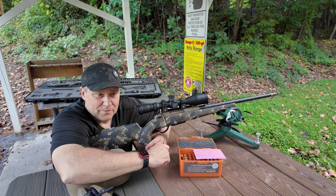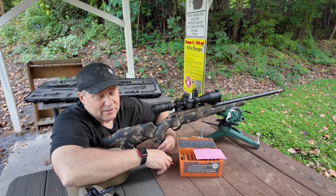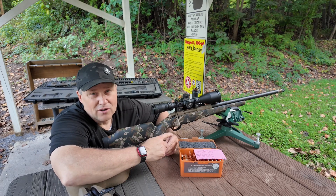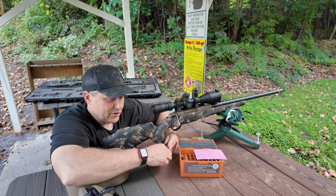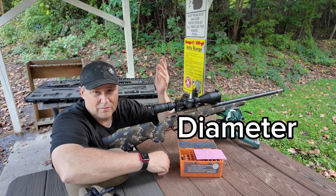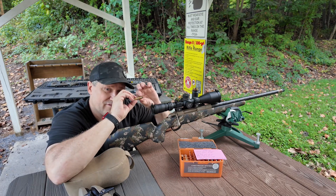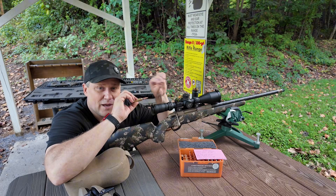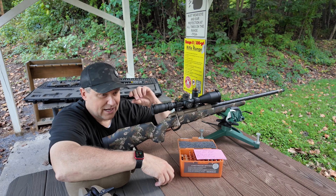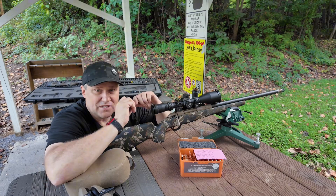Alex Wheeler is the one who developed this. Alex Cortana is certainly someone who has given it a lot of popularity out on YouTube. Being real candid about why I have this — I have a good friend who has one and made the reamer for a barrel to work with this. When you make a barrel, you make it in a caliber — 7mm, 6mm, 6.5mm, and so on — but then it has to be cut for the chamber so that the cartridge can fit in it and the bullet can be loaded up into that caliber.